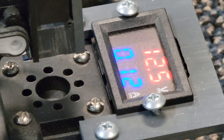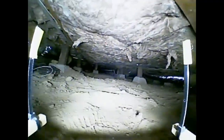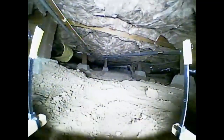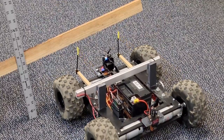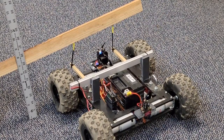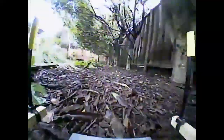The system draws two to three amps at full speed and can go just about anywhere in the crawl space unless the headspace gets too low. Mounted on the front of the chassis are a pair of cable-tie feelers — if I see the feelers touch anything, I back away before the crawler gets stuck. Once I had to rescue the crawler after it got tangled in some old telephone wire, so I'm very careful now if it has to roll across any wire or cable. The camera signal is transmitted to my desk computer, and I can capture still shots or video using the Windows Camera program while I drive the crawler with the RC unit.